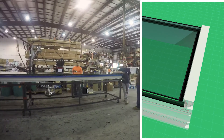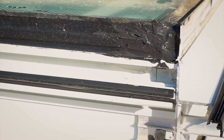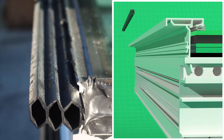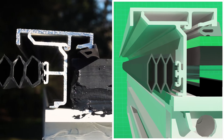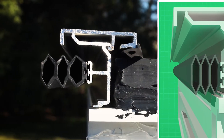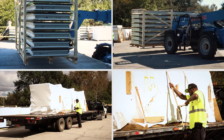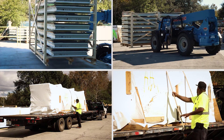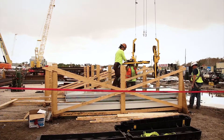Once that's done, any other gaskets required for sealing one panel to the other, or sealing the top and bottom of the frame to the adjacent substrate, are slid in place. There are also Tremco wedge gaskets put in place in addition to the weather seals. After it's trimmed out, we put the frames into what we call a bunk — a wooden rack — laid flat for transportation and storage on site until an opening is ready.